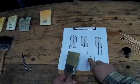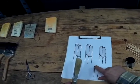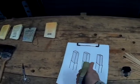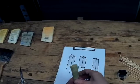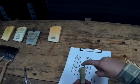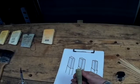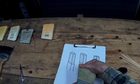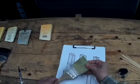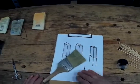And my theory on that is that that'll let the paint flow out of the brush a little more freely, which might speed up the work. And I'll show you the advantage when we're at the sash painting that this square edge gives when you're brushing, lapping the paint over onto the glass a little bit. We'll see how that works when we're painting. All right. So that's my improved sash brush. I like it.